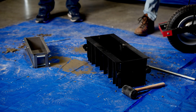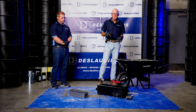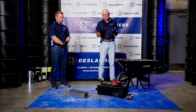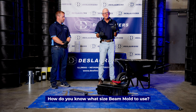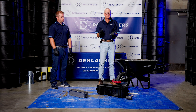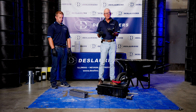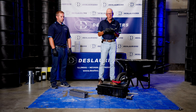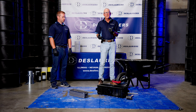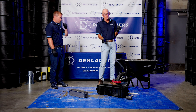There are two sizes of beams available. This smaller beam is four inches by four inches by 14 inches long. The larger beam is six inches by six inches by 21 inches long. The selection of beam size is typically determined by several factors. Generally speaking, if it's one inch aggregate or less you can use the four by four. If it's over one inch aggregate you need to use the six by six.